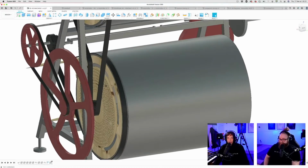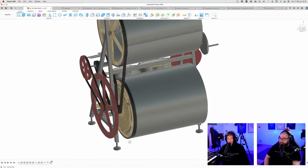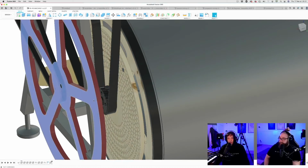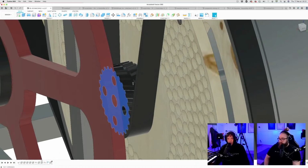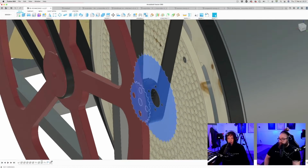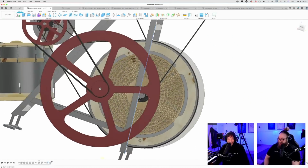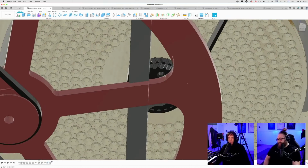Look here. I think this drum is going to rotate half as fast. So the gear ratio to this drum is not going to be 1:8, but it's going to be 1:16, which means that this little friendly pulley down here needs to be 4 times as large, which means we can make this pulley down here and this indexing disc the same part. Auga! So we can cut all these holes in the black pulley.